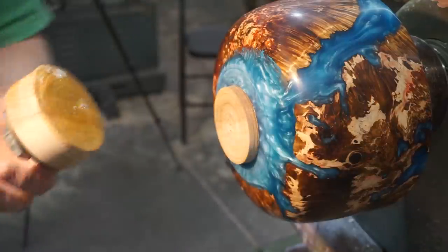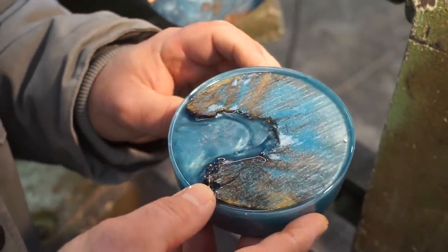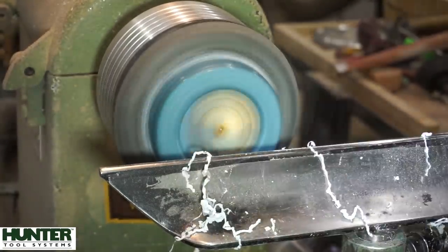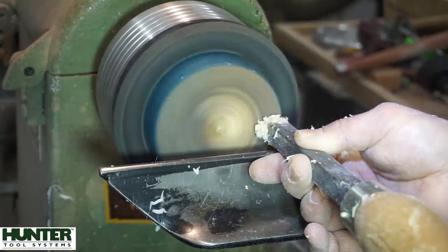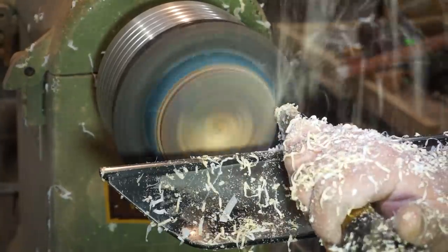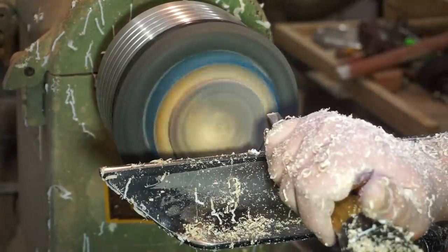There's the denatured alcohol, just cleaning the surface prior to finish. I wanted to put a glue block on the bottom so I can handle it - there's the glue block with hot melt glue melted in an electric frying pan. Here's our lid - it is made from the same box elder burl as the urn. I figured the best way to do this was to put it on my vacuum chuck. If this piece was maybe another quarter of an inch in diameter it would have been better, because it was actually moving and being sucked in on one side - it just barely fit. I'm using calipers with the measurement set from the urn, trying to sneak up on the fit - I want a snug fit but not super tight.